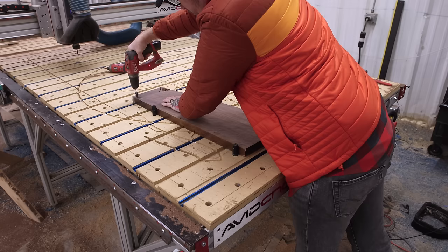I underestimated just how difficult clamping to the pedestal base was — you only have about a minute of working time, so the first piece went right back into the steam chamber when I couldn't get it clamped. Then I tried bending it around a 4x4 clamped in the vise, and right away it cracked. The steam bending aspect of this build is ruined, but I was determined to bend at least one piece of wood to learn as much as I could. While I managed to actually steam bend wood, it's safe to say it was a complete failure — two pieces broke pretty badly, likely because I was bending wood too thick past its tolerances. I've obviously got a lot more to learn about this technique, but I'll tackle it again — I've got a steam box and generator now, and it's a really neat, interesting process.